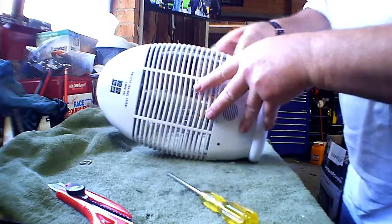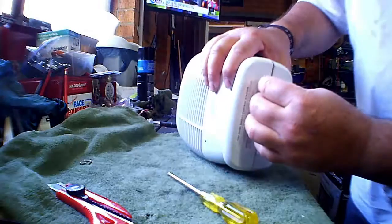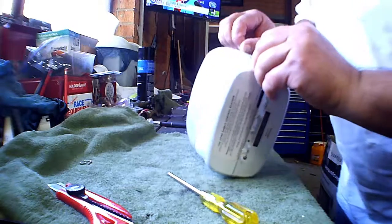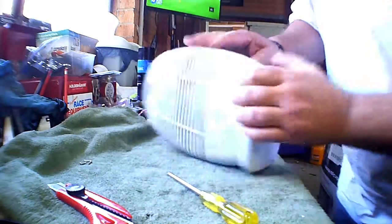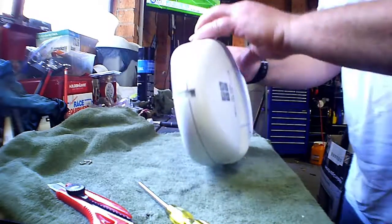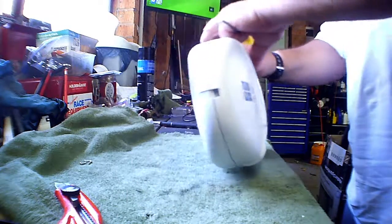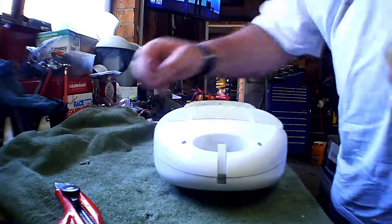Still not sitting properly on this side. You can see where I cut the labels all jagged. But at least I think it's the wiring looms in the way. I think it's actually supposed to fit in. The flange fits together past the wiring loom. There we go. So the wiring loom had come out of the channel and wasn't allowing the flange to go in.